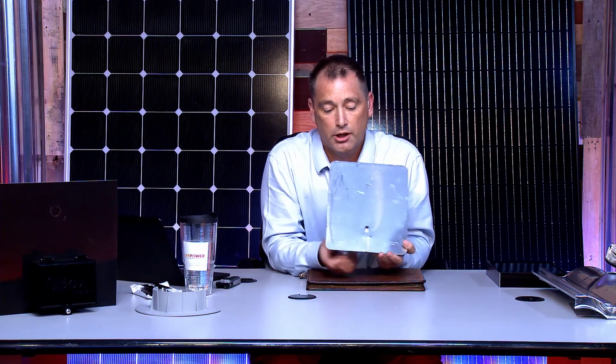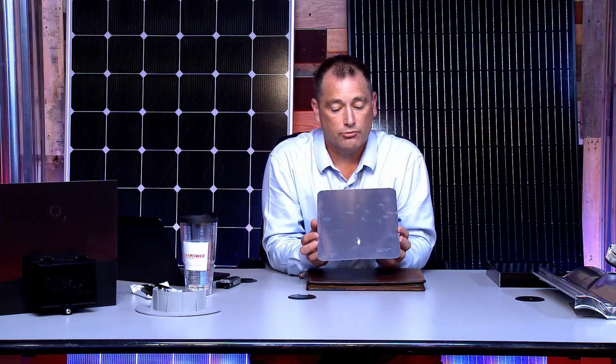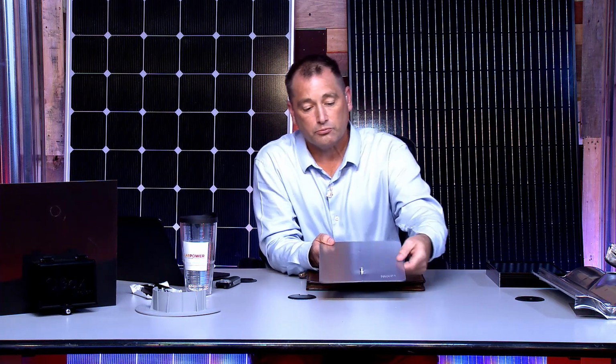It's actually kind of cool how they do this now. There are so many things on this flashing here, and I'm trying not to show a certain brand, but if you look at these flashings, they actually have notches on either side, and one right here on the bottom. The reason the notches are on here is to follow a chalk line. It sounds crazy, but when you look at a roof, a lot of times shingles are not straight across a roof.